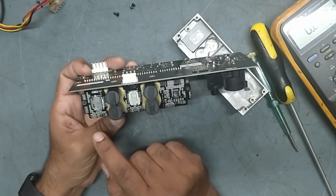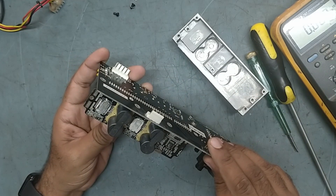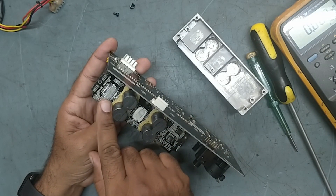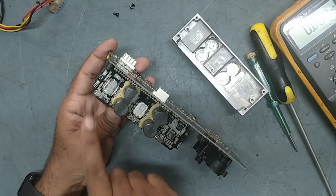So we need to replace both ICs with new ones. This is the same TDA8950 — the IC number is 8950. This one is LF and this one is HF. Both ICs are defective because voltage is coming on the output.